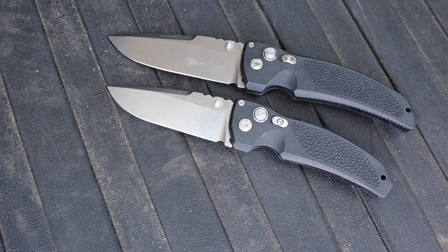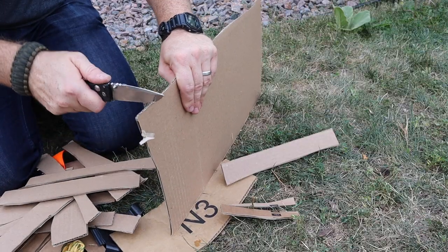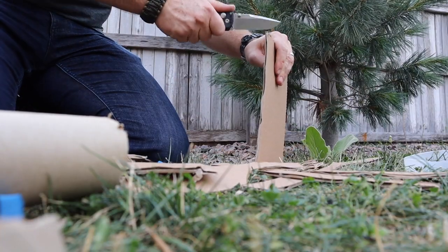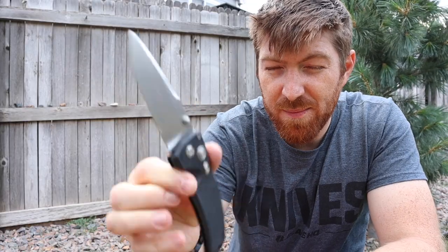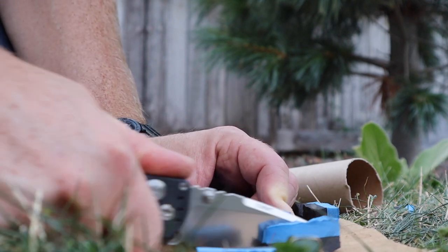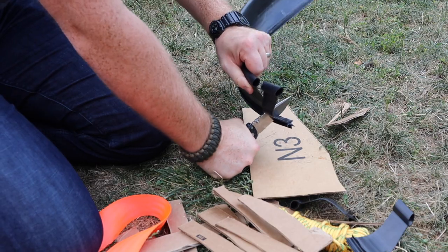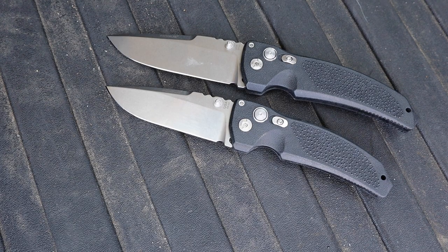This is designed to be a little more heavy duty — not a scalpel, not a Spyderco Delica with a full flat grind at 0.1 inches thick. If you need that, these aren't the knives for you. But if you want something heavier duty that can still handle daily EDC tasks, these absolutely will do that. Made in the USA with 154CM steel — not a super steel but definitely on par for the price. Rockwell hardness 57 to 59, which is great for a utility blade: easier to resharpen, less risk of chipping.